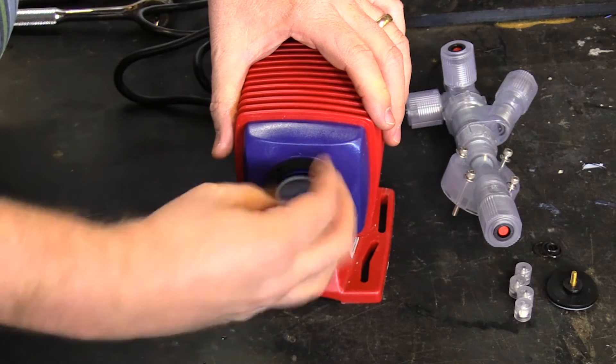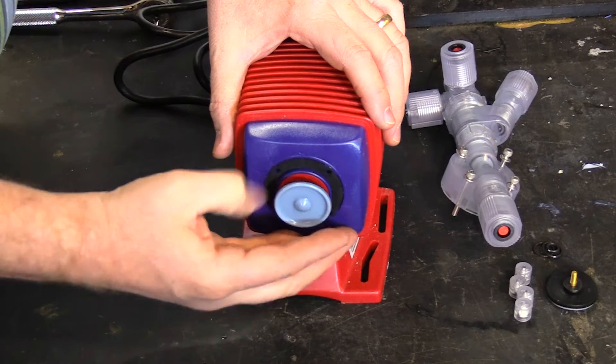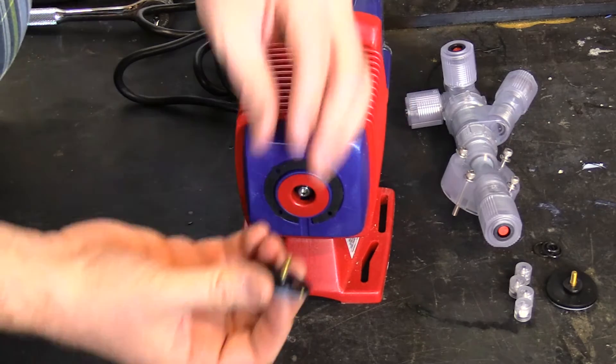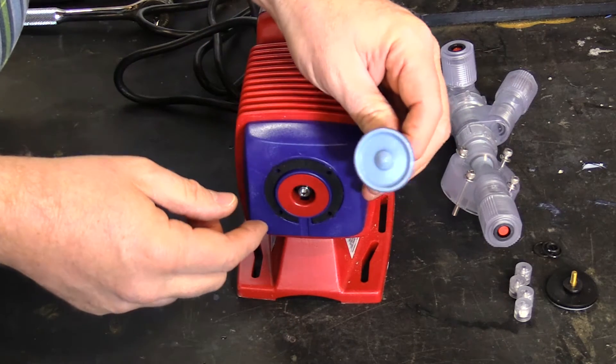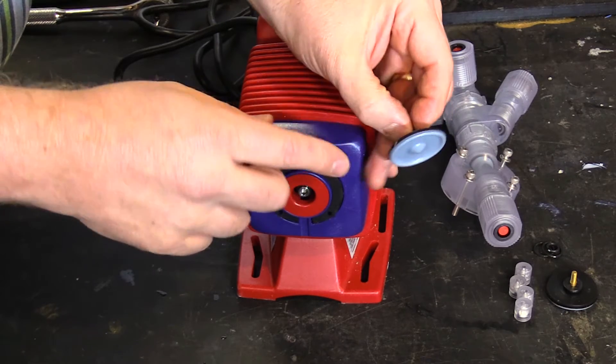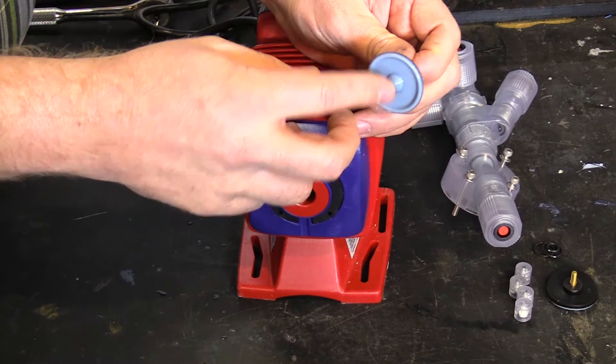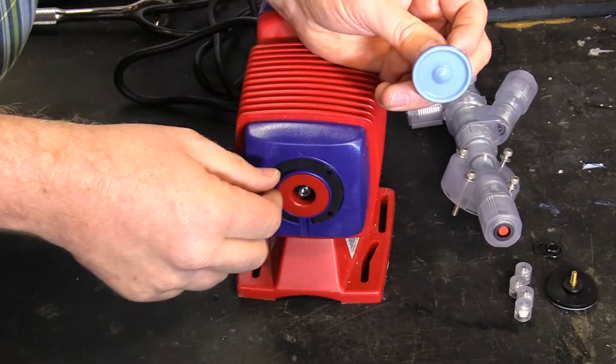Remove the diaphragm and the little spacer behind it. You'll know when the diaphragm has failed when it has separated — when the Teflon face has separated from the rubber backing — or there will be milky white spots within the diaphragm, or the diaphragm is frayed.